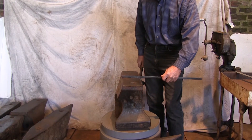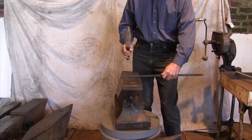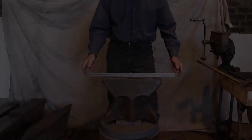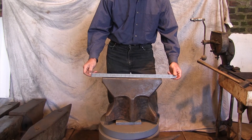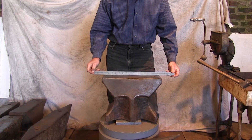You can see clearly here that the top surface is not parallel with the bottom. When I put the bar level I'm in a perfect position to work the edge — this is one of the fantastic details of this anvil. Here we can see about a one-tenth of an inch of saddle, and on either side of the saddle you see two crowns that are very useful.